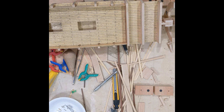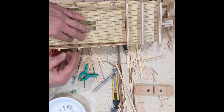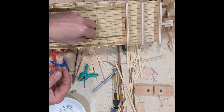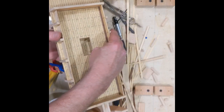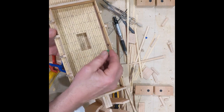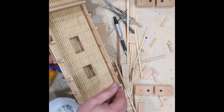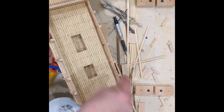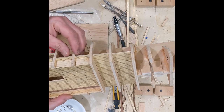Oh, but what I wanted to show you before, I'm not going to show you me sanding. I cut the other side of the walnut down to size. And basically what I'll do with that, same thing I did here, I'll sand it and get it smooth down to 600. And what I'll do is I'll take my thumbtack. Why can't I think of thumbtack? And I'll go right where the bulkheads meet it up at the side, and I'll put a little pinhole in it. And I'll pre-drill all the way through the walnut, push the walnut into place, and push the nails in.